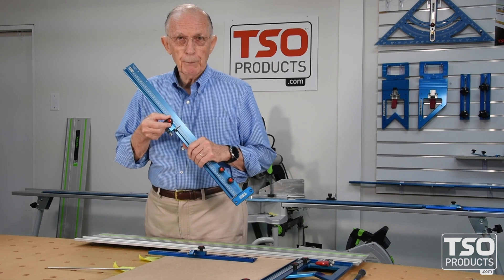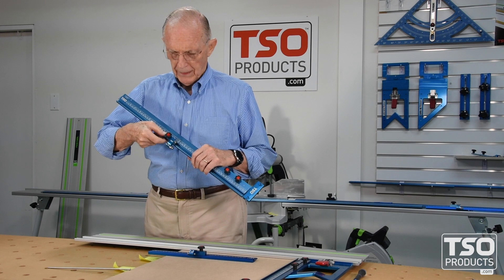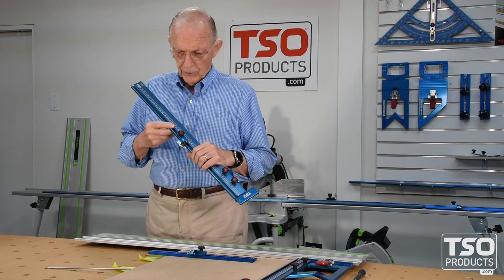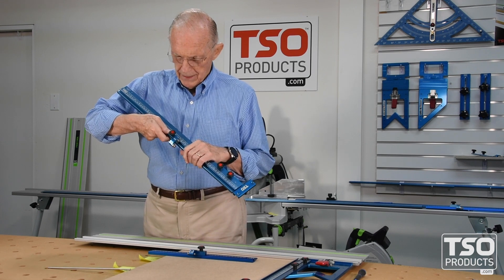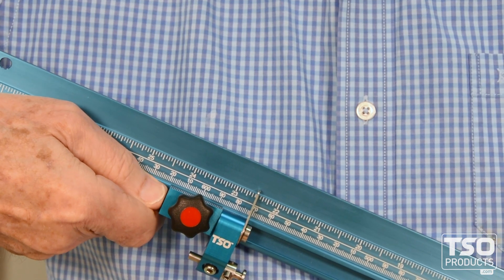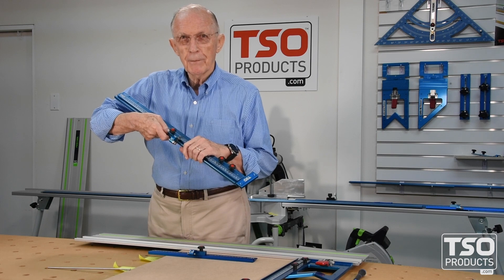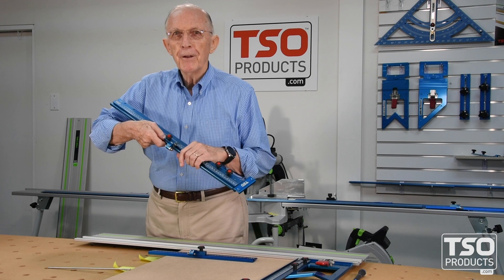It still has the locked capability, and of course it can be moved — but notice the difference. I moved it, I didn't tighten it, and it stayed put. Now I can make tiny little precision adjustments by moving the flipstop with just rotating the tip of my thumb. Watching it, it's barely moving — tiny little amounts for great precision, greater adjustment control. You'll really like this.